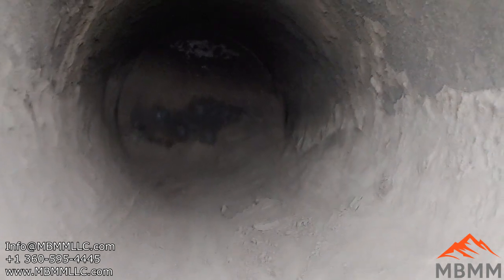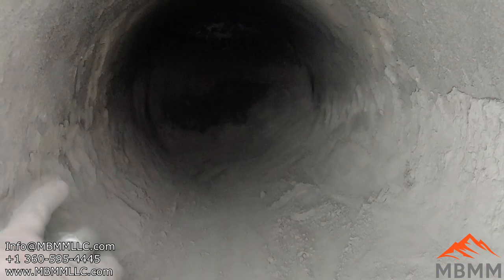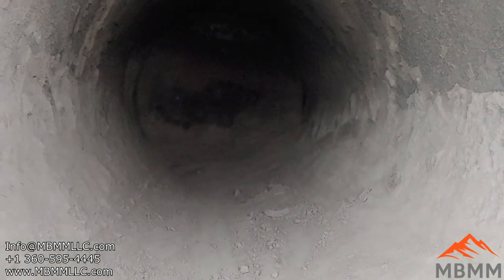Okay. I got all the balls out. There's still quite a bit of material kind of stuck on the sides here. So I'm going to turn the mill back on and see if I can vibrate some of that all loose. But I have noticed that it just gets caked on here on the sides, and I'll be interested to see, this is just a mild steel tube, and I want to know if there's a bunch of steel filings in the fine stuff that we crushed, or if the ore makes kind of a padding on the inside here and protects the steel from getting eroded.